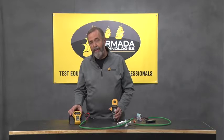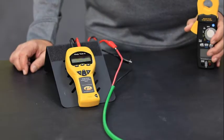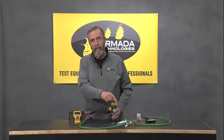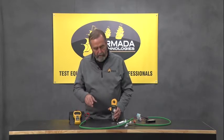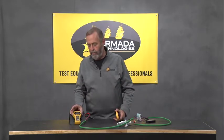The Pro 50 wasn't designed originally to do this job, but we realized that when it's doing the 24-volt solenoid testing it provides the kind of current we need in the cable. So we can use the Pro 50 to source current and allow us to use the clamp meter, and it doesn't matter whether we have any power — all we need are the AA batteries in the Pro 50.